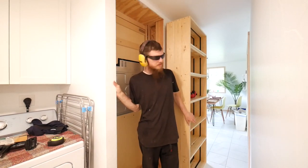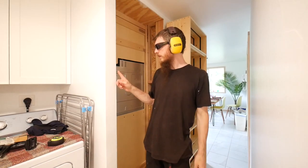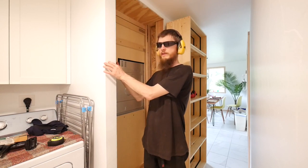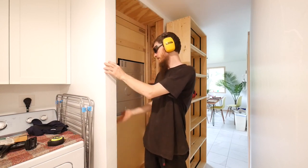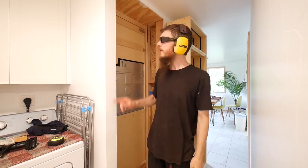The shelf should have been a little narrower. It came out about an eighth of an inch wider than I expected — not sure if that was because the wood was thicker than I expected or just the sloppiness of putting wood together. I should have made it shorter. But I can cut this away because behind here is just a flat two-by-four sideways, and it's going to be easy to just trim it back a little bit. We'll widen this opening and hopefully the shelf slides in.